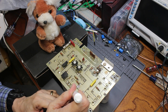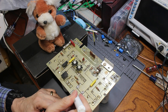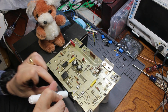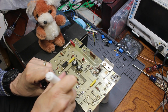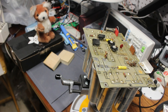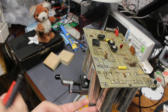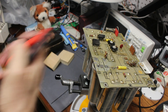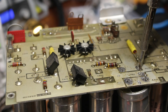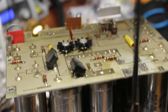More flux and try again — rinse and repeat. Finally, I gave up on the idea of trying to reform the capacitor and decided just to get it out by cutting the lugs. Sometimes you have to do that, because the can of the capacitor is such a huge heat sink that you can't get the joints hot enough to desolder. I managed to get two of the lugs with a flush cutter, and there was one wide one that I had to spend some time with a file off camera, paring it down to where I could get the cutter jaws around it. But the two lugs on the inside I couldn't quite reach. The can is loose enough that maybe I can heat them up and wiggle them loose. It's moving a little, a little more — got it! Yay!